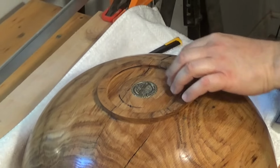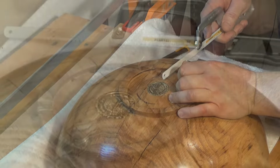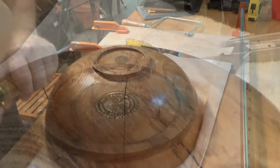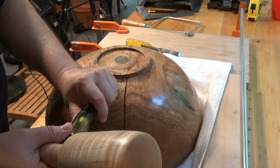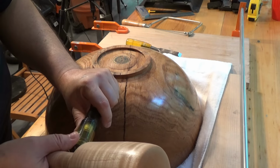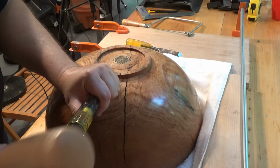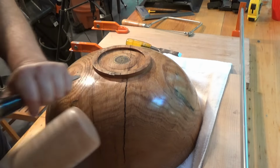The internal side of the ring is shallower than the external part, so I will try to cut to the depth of the internal side, perhaps even a hair shy. Being careful to respect the cuts I just did, with the mallet I prepared in the previous video and with a small chisel I will begin to chip away the excess.